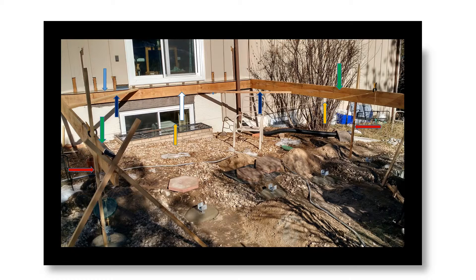It should measure 16 feet across at all four points. If not, make adjustments. Also measure corner to corner diagonally and make adjustments if the measurements are not the same.